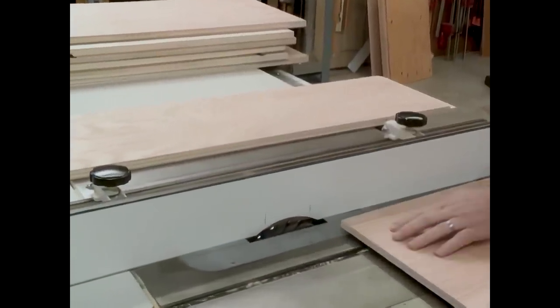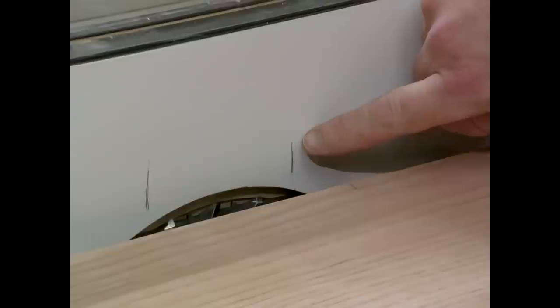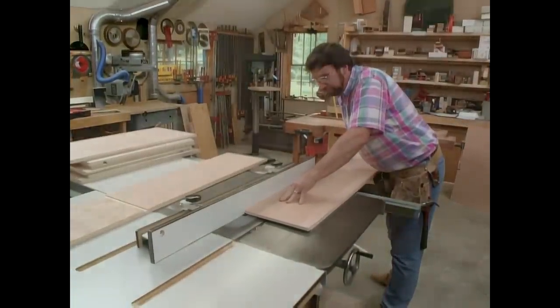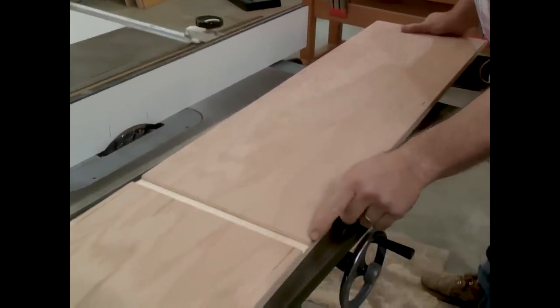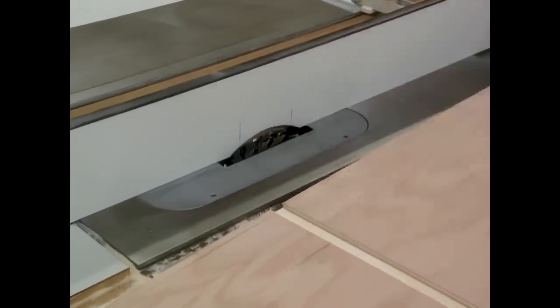I'll show you how I made those. For one of the side pieces, I can start at the top and make the rabbet down to this indicator mark, which I'll align with an indicator mark on my fence — that's the leading edge of the dado head cutter. The mark on the side is where the rabbet will intersect the dado. The other side is a mirror image, and I want to run the rabbet from the dado to the top. I'll use this indicator mark, which is the trailing edge of the dado head cutter, align it with my indicator mark on the panel, drop it down, run it through.